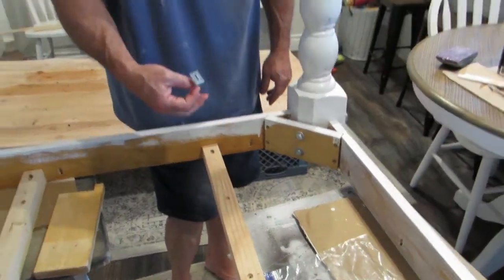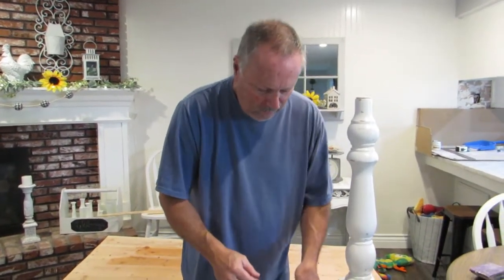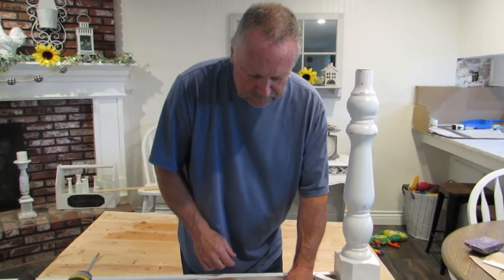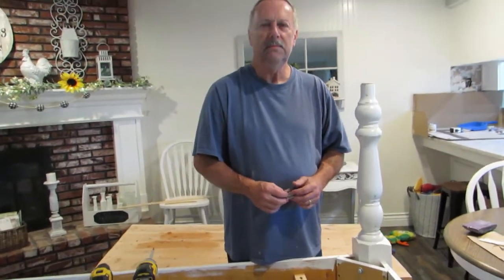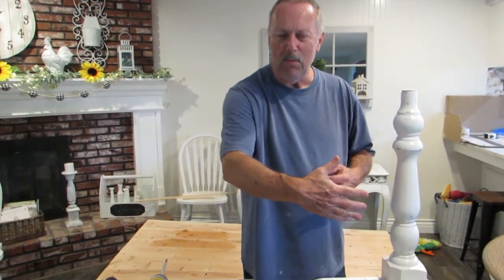So I'm glad Debbie found that on the internet, because I don't want my wood cracking. And it will look awful. Some of the things that we've seen on the internet, it really split open. It went up. It went everywhere. Yeah, there's some YouTube channels, more professional woodworkers than us, that was trying to warn people, because so many people are making their farm style tables. Also when you put the breadboard on the ends, which I'm not going to do, that's even worse, because it'll actually split that end board.